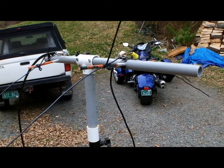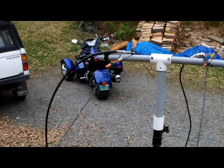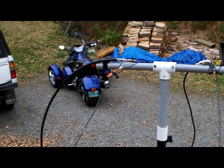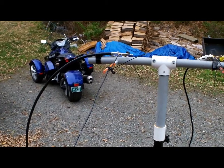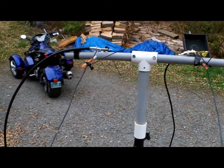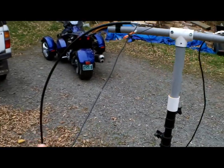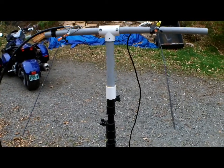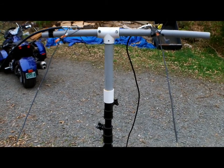What you want to do is place an inductive load on the dipole that is switched out. You'll need a double pole double throw switch, which I will construct exactly like I have on the 40 meter array — not a big deal, done one, you can do it again. I've got two dipoles here, they're inverted V's, the exact same length, spaced 13 inches apart, which is 0.16 wavelength on 144.2.